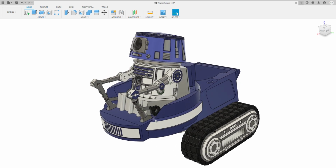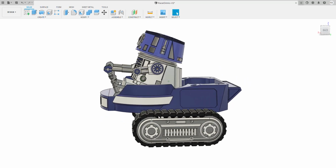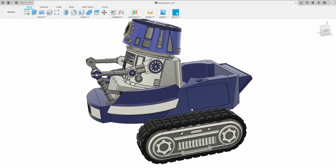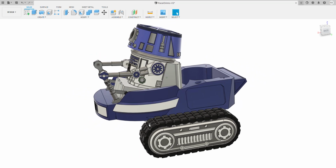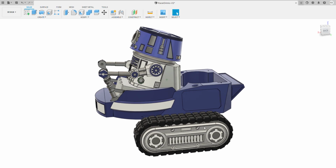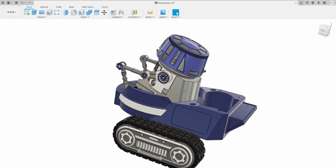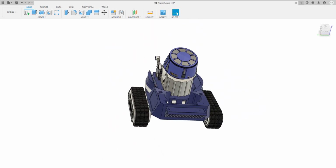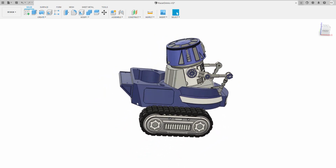And I've also ordered some electronic speed controllers that will handle up to 16 volts, because what I'm going to run is 4S in there rather than 5S, which is 14.8 volts, maybe 15 volts, on the double speed motors. Now, in this configuration, without the extra weight, this thing will fly like a little racer, okay? So you'll have a couple of configurations.